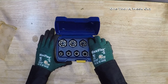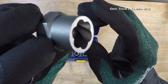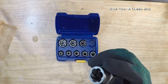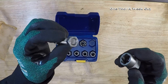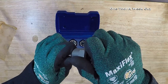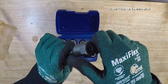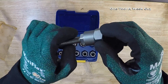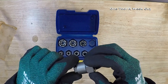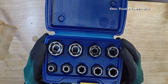These have reverse spiral teeth designed to bite down. You can see they're spiraled so they catch bolts or nuts. For example, if you have a rounded-off nut, you place the extractor on it, swing it the opposite direction, and the teeth thread into it and pull it out. As you can see here, the teeth cut in and it's able to extract the fastener.